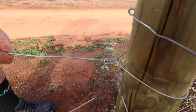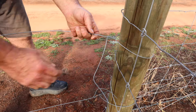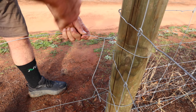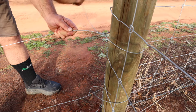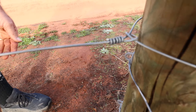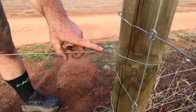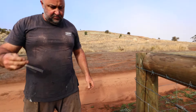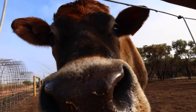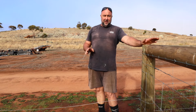I grab the tail, go under the long length that goes back — like that. Then I come in about 100mm, put a bend, and this is my little handle. I pull this up tight and I give the wire going back to the fence just a little kink like that. Now I grab the handle and basically wind it around — I like to go around about six times. So that's four, five, six — and we've got a knot.